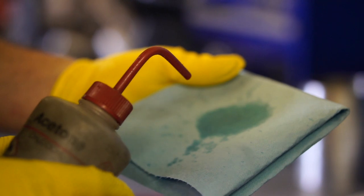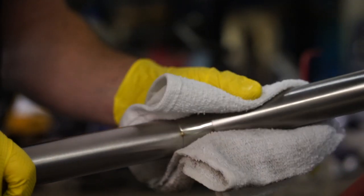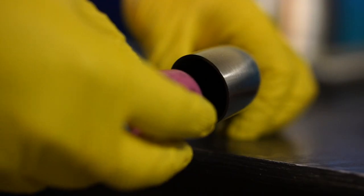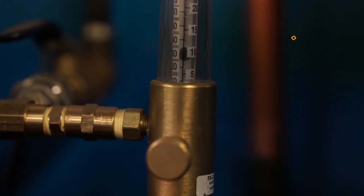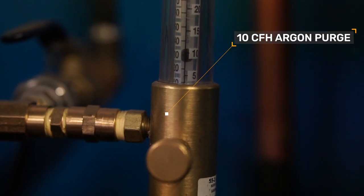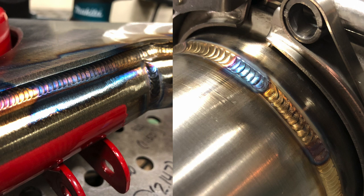When any reactive metal — anything that reacts to atmosphere in a certain temperature range — is exposed to atmosphere, some form of oxidation will occur. That can be as simple as grinding a mild steel bracket and not quenching it in water as you go, so it gets hotter and hotter until the material reacts to atmosphere and changes colors. Oxidation creates a layer, an extremely thin layer. What you need to know is as the layer thickness increases, the wavelength of light transmitted changes, and so does the color of the weld.